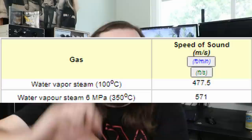On the steam whistle, you need one extra piece of information to make that calculation happen. And that's the temperature of the steam. This whistle is being blown with air, and it is being blown in air, and that's it. A real steam whistle is enveloped in a cloud of steam. And depending on the pressure the locomotive operates at, the steam may be quite hot or it might be less hot. And depending on the amount of flow, the steam might be pretty hot or it might be less hot. And the heat of steam actually changes the speed of sound.